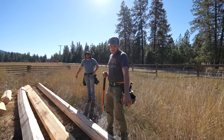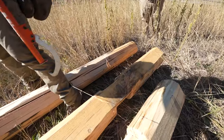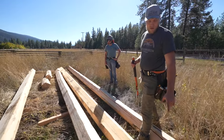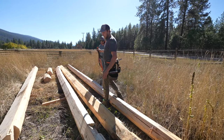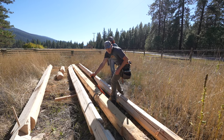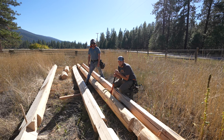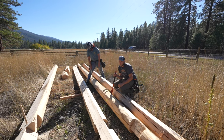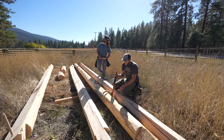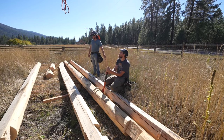Okay, so here's our purlins. You can see the 10 right here, 10 right here, and 9 over there on the other end. So if you look at this log here, we had 10 on the left, 9 on the right, with the pitch coming down towards me. So we're going to turn it so that it has that approximate pitch. It's pretty much just an eyeball thing. We know that that's pretty steep. It's about a 12-12 in this case, which is actually a 45 degree angle. We're going to eyeball a 45 degree angle here and hold it with this, and then we'll hook it up.